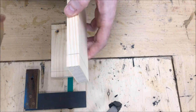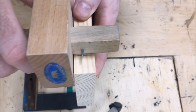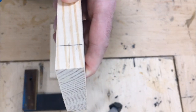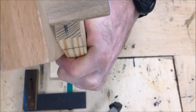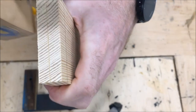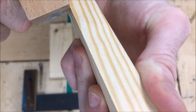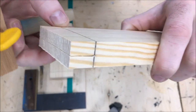Then I take my piece and get the marking gauge. Starting on the right hand side of the piece, I put the shoulder against the right edge and score a line down the piece, just as far as the pencil line - we don't need to go any further. Again keeping on the right hand side, I score a line all the way across the piece. If you find it difficult you can place the piece in the vice. Then starting on the right hand side again, I score a line up. Now I have scored lines all the way around.